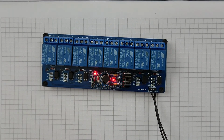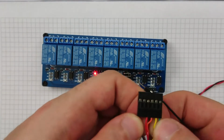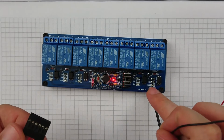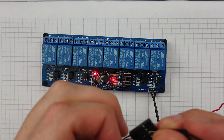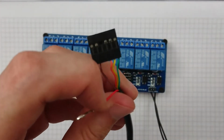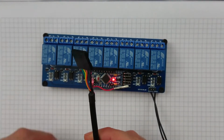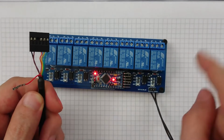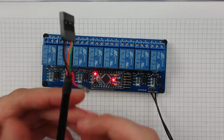So where's my, oh, there you go. This will be a suitable pokey. All I really want to do is to just remove the power from here. This may actually have been what this was about. I don't know. We'll see. It's just me faffing around at my desk really, and a bit of a learning experience. So there we go. If we pull that out, it should now be perfectly safe to attach to the computer, and we won't be competing with power supplies. We'll connect the grounds together so that they both have a common reference and they can communicate, and the electrons or the angry pixies will dance less angrily.